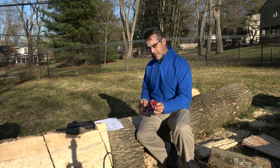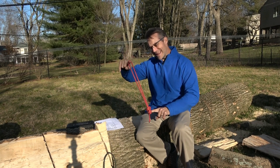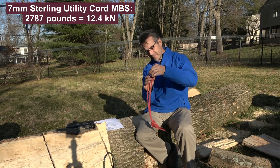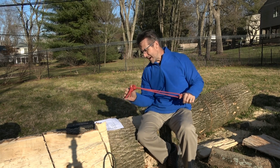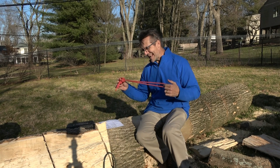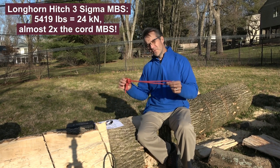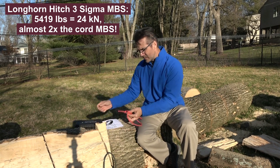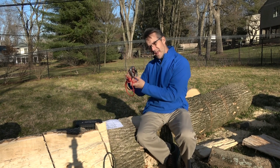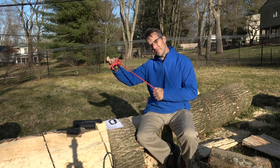I'm going to give you the numbers for this Longhorn hitch when I pull from end to end, breaking it using sterling cord with an MBS of 2,787 pounds or 12.4 kilonewtons — I've got two strands absorbing the load. When I pull this to break, I got 6,104 — 5,660 — 5,981 — 5,905 — and 5,885 pounds, giving me a three sigma number of 5,419 pounds or 24 kilonewtons. In layman's terms, this climbing-rated carabiner is typically rated at 24 kilonewtons end to end — this and that carabiner are approximately the same strength. I can trust my life on this.